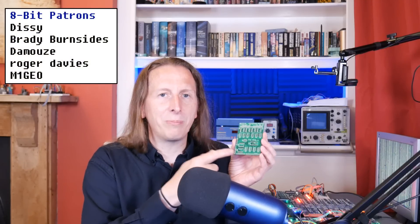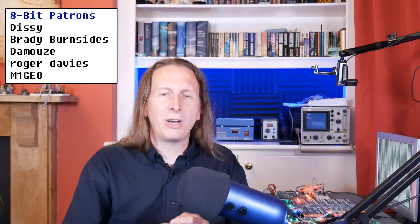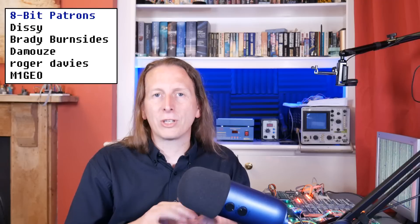I'd reversed the bits between memdata and these registers up the top, and that caused some visual artifacts. I did manage to resolve that in software by adding code that inverted the bit order before writing data. I also managed a hack involving switching the cables around that got it more or less working without needing the software hack, but I really do need to fix this circuit properly.